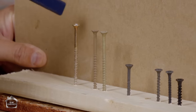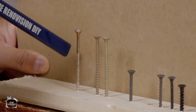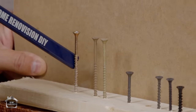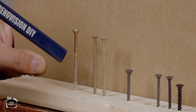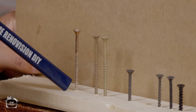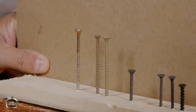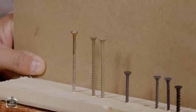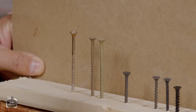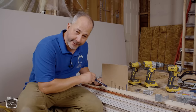We have a construction screw. This is a three inch screw, it's a number eight. It is a pretty good steel screw with a zinc coating. The idea here is that you can pretty much attach anything to anything with this thing and it does most of the heavy lifting. Most of the situations you're going to use this is when you're doing some light framing, back framing, or adding blocking for your towel rods in the wall before you close. This is for interior use only.